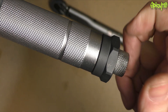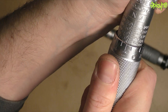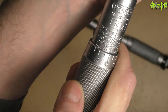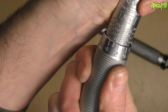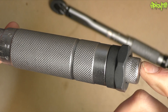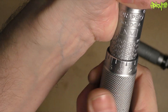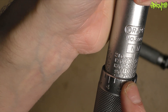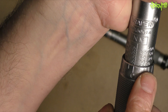You loosen off the locking screw here, and then twist this until it is underneath the line on zero. Zero, two, four, six, eight. So we know because we're at the bottom line of the zero on 60, we're at 60 newton meters. To do 62, it's as easy as that. Then go back to the end cap and tighten this up so it won't move. Just remember: bottom line gives you your 10-value. So 60 with a zero, and then that's 62, 64, 66, 68, 70 — and you'll now see we're back to zero at the bottom of the 70 line — 72, 74, 76, 78, 80. And we're now at the bottom of the 80 line.